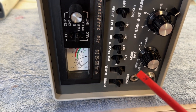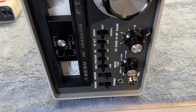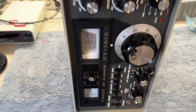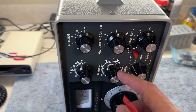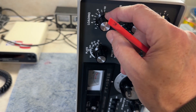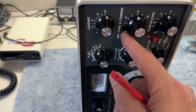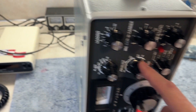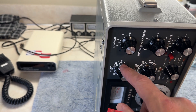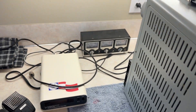60 milliamps of bias - if you don't have 60, come back here and adjust that bias until you've got it. Once that's set, flip to tune. Since we're on 29, I have these knobs close to 10 - basically put them at 10, 10, and this one is usually right around 3. Then I go about halfway on the carrier and start tuning, starting with this knob for maximum power.